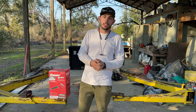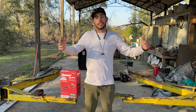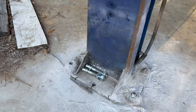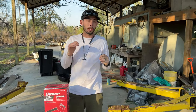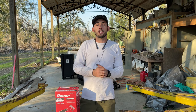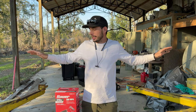What is up you guys? Welcome back to the channel. So we have some explaining to do. As you can see, we got lift arms up. We got pretty much everything done. The only thing we're lacking is we got two holes left to drill. We tried to drill through those — spent a couple hours, went through a couple different bits and we hit rebar. So we've got eight other anchors in and we're lacking two. We ordered a bit called the Diablo Rebar Demon — it's sick. We got it off Amazon and it'll be here tomorrow, and then we're going to drill through those and finish anchoring this thing out.